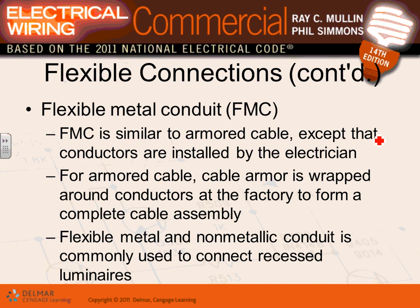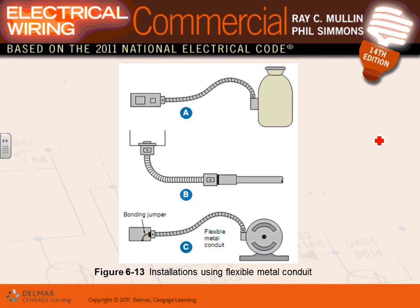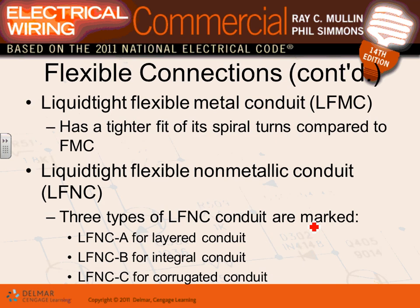The main reason for using flexible metallic conduit is tying to electrical equipment: air handling units, chillers, rooftop units, fans, pumps, lighting fixtures — any electrical equipment powered with electricity. Typically it runs from a junction box all the way to the electrical equipment.